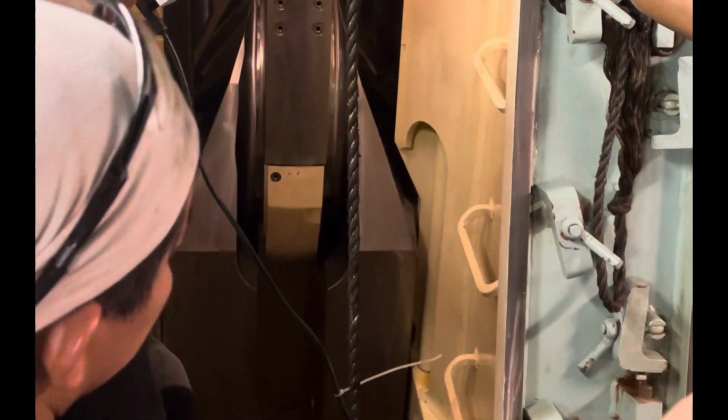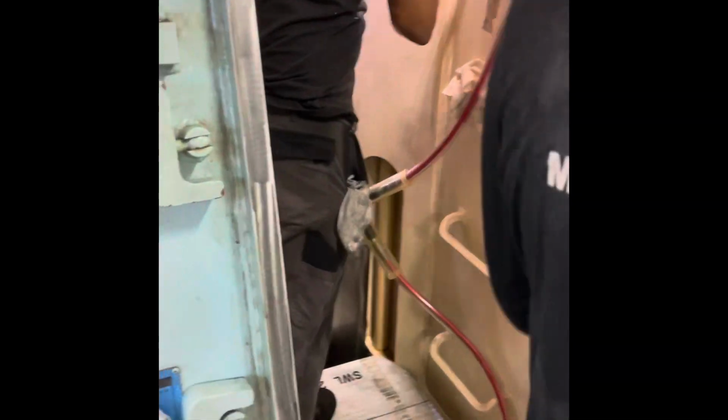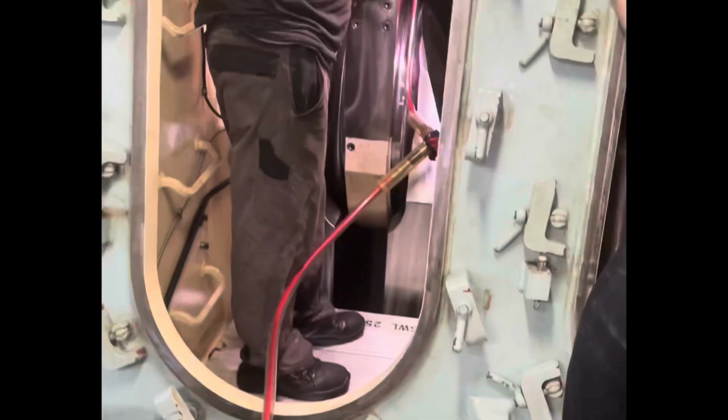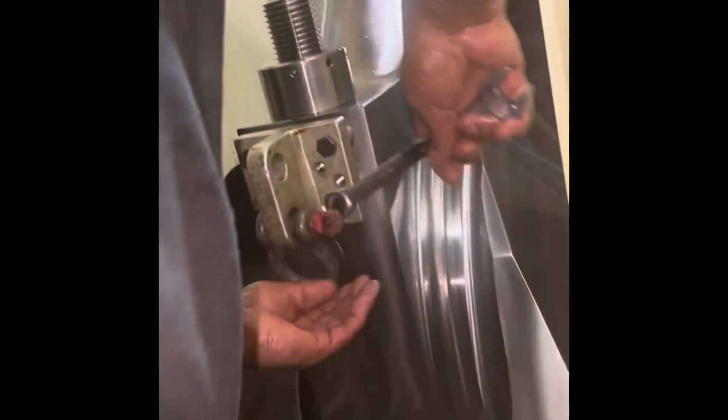Then place the crankpin bearing removal jacks, connect the hydraulic hoses and increase the pressure to 1500 bar, which is the opening pressure. Then loosen the bearing bolts. Then connect these tools to the connecting rod on both sides. Then place this crosshead support tool on the forward and aft side to take the crosshead weight.